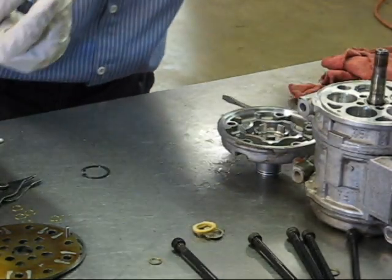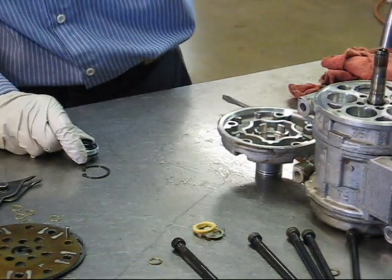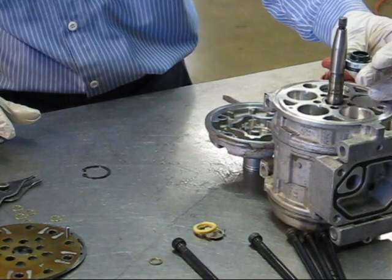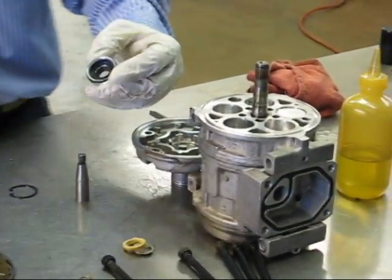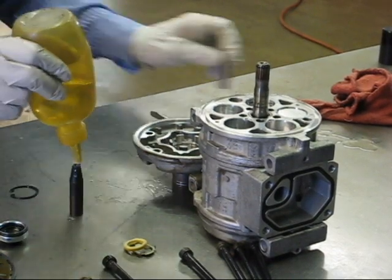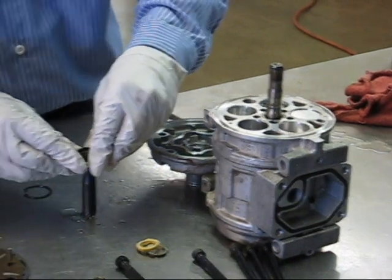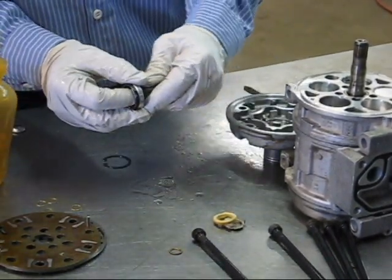Here is a trick with lip seals. When you install them you must use a lip seal protector that slides over the shaft and will basically shoehorn the lip seal onto the crankshaft. So the first step is we need to precondition the seal to go on. We take our seal protector, very liberally add mineral oil to it, and oil the center section of that seal. We take it, insert it, and slide it over the seal protector and pull the protector through.